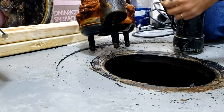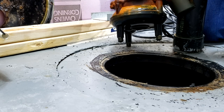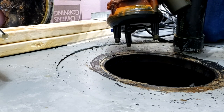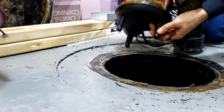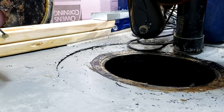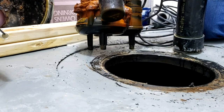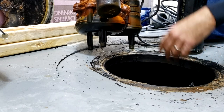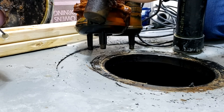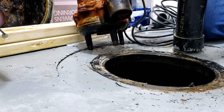It's a tiny one — much smaller, lighter, and not as heavy duty as the one we're going to install. This actually does not look like a sewage ejector to me — this appears to be a sump pump. Sump pumps are typically not designed to discharge debris. The opening at the bottom is only about an inch and a half or two inch diameter, whereas sewage ejectors are bigger. The discharge is two inches, but usually the opening underneath a sewage ejector is much bigger than this. It's a Titan wastewater pump — and this Titan is going to be retired.